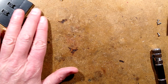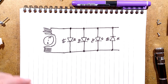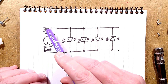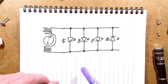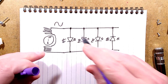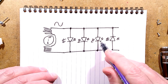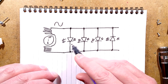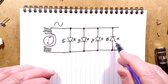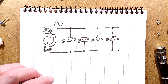The LEDs are wired as shown. We have the spinning magnet, the two coils, and it just creates an AC output. It will pretty much be a sinusoidal output, except that it will be clamped by the LEDs. The three gallium nitride LEDs — two blues and the green — are in one polarity, and the less efficient and lower voltage red LED is in the opposite direction.